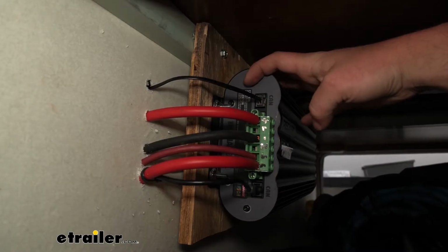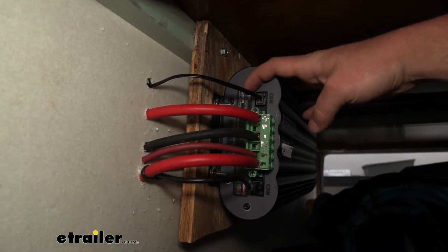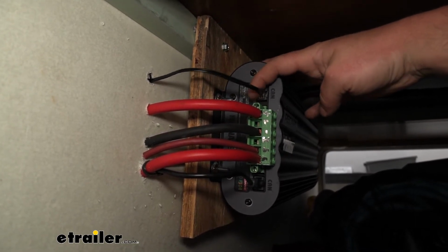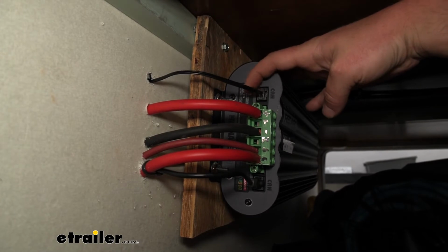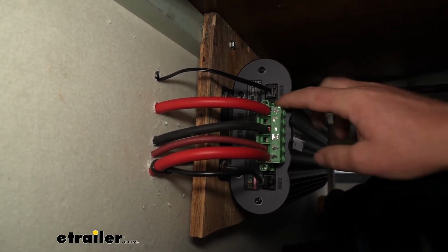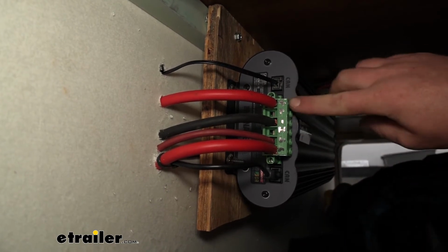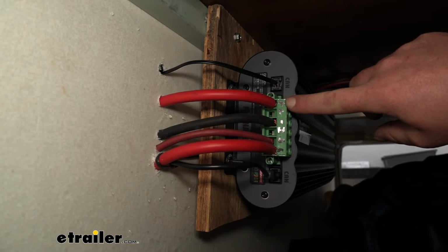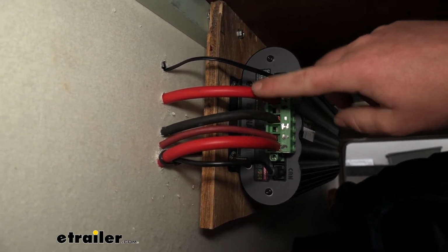So now back here at our main unit, as I mentioned, all of those wires that we ran in, we can now get them hooked up. The CAN wire right here that comes from our battery sensor just gets plugged right in. Then we can focus on all these. All right, so slot number 1, where I have this positive sign, that's going to be the red wire here